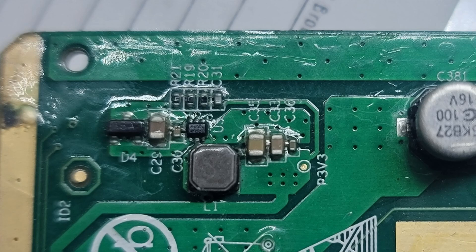Right here is a chip — let me change the color so you can see it. This chip controls or makes the 3.3 volts. First check: it should be 12 volts on that input pin. This one is ground, and this one here is the switch output, which is the voltage output — that should be 3.3 volts.